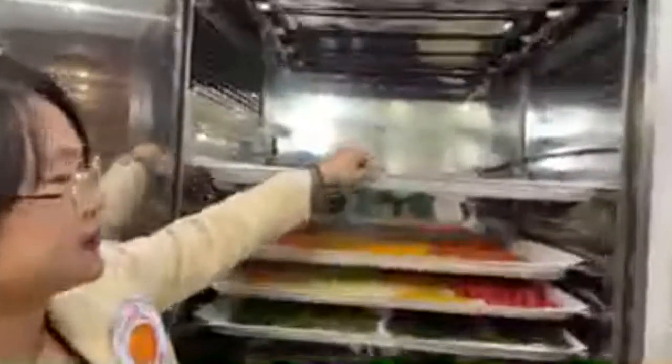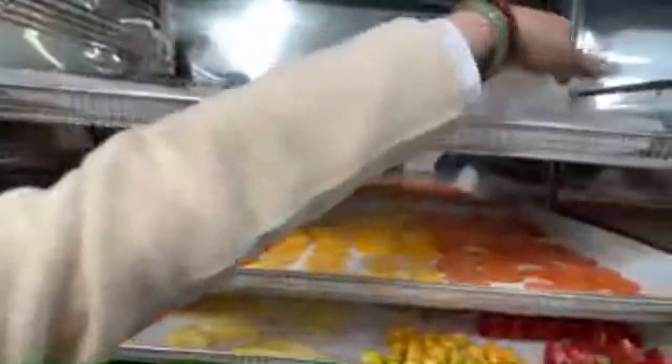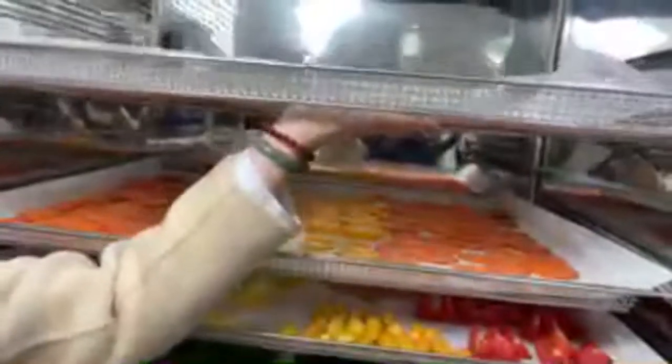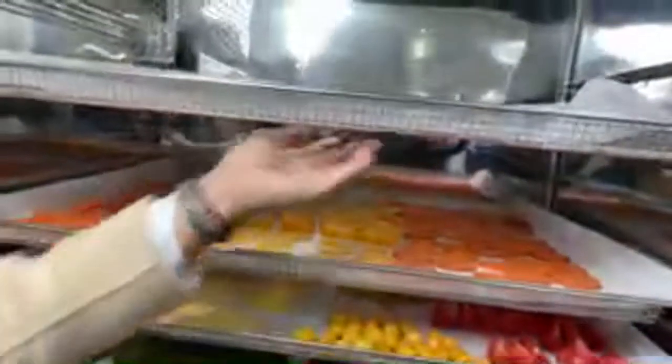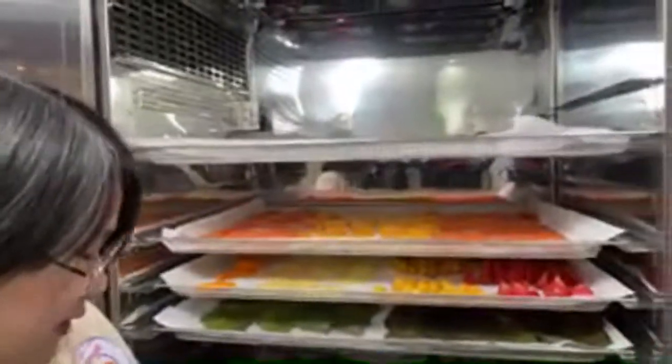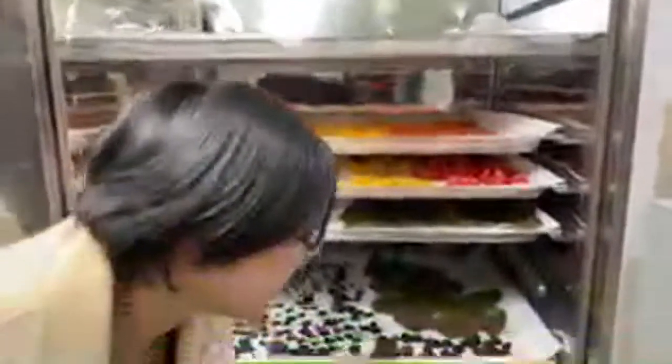As you can see, here are some special chains. This is our standard chain, stainless steel, material 304. Yes, this one. The maximum loading is 10 kilos per piece. So it's very strong. And if you have a customer who doesn't need that, maybe another one is a better choice, like this one. But this one, you know, the maximum loading is only 3 kilos. So we need to choose depending on the different materials.